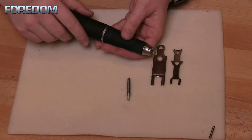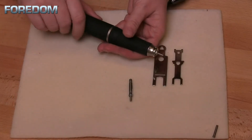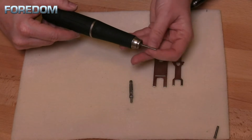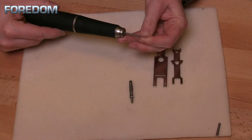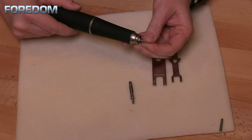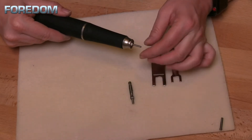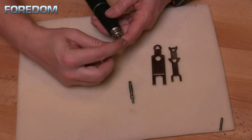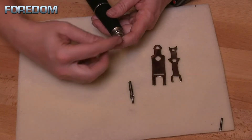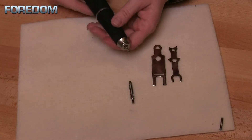There are two dots on this little silver ring, and it's either going to line up with locked, in between, or unlocked. When it's unlocked, you are able to remove this mandrel and install any other mandrels you want. The in-between state allows you to basically lock the collet and the mechanism entirely — handy if you have a screw mandrel. You can lock it into place, unscrew, replace whatever you need, and retighten that screw.